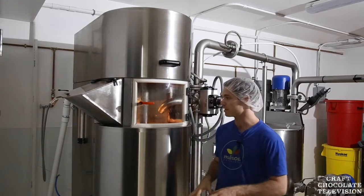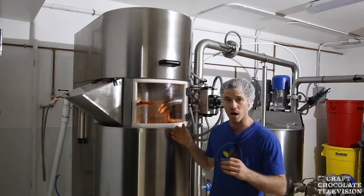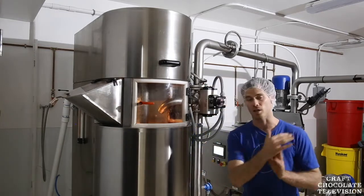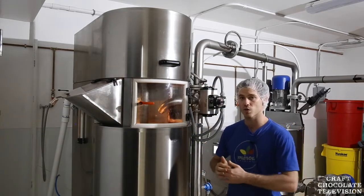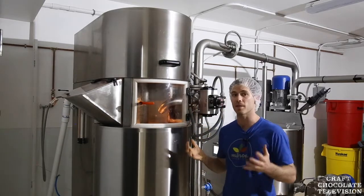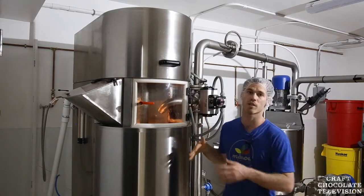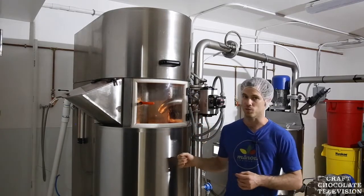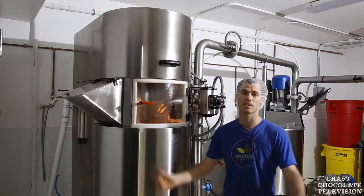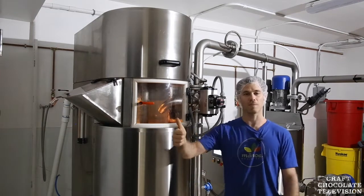This room is really insulated and easy to clean. Everything gets flushed with water when it gets too hot, and it dumps into a floor sink that goes out, so we have a lot of control over the process. There's also a little vent so that as the acids come out of the chocolate, they get sucked up and blown out — we can get rid of a lot of the vinegary acidity in this initial phase, since much of it burns off during refining. That's ball mills — please send us your questions, we love ours, and happy chocolate making!